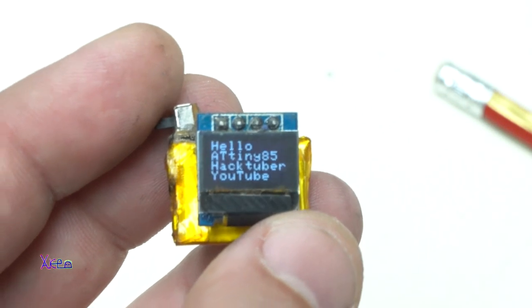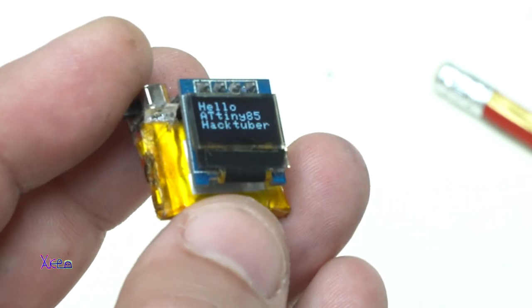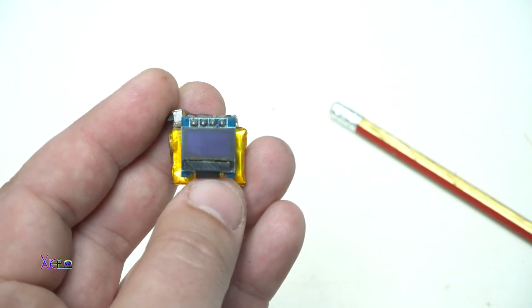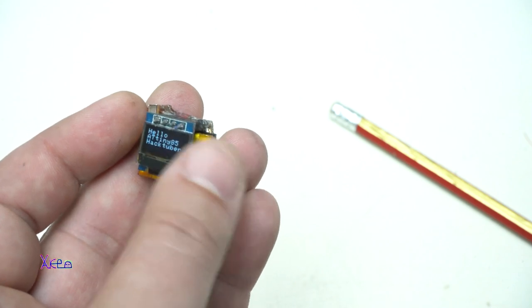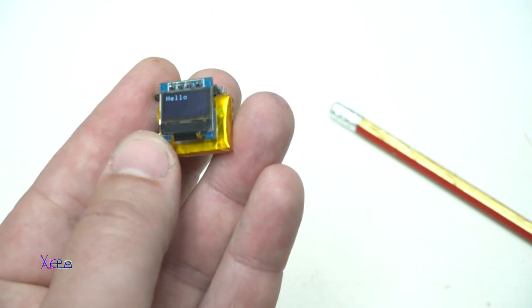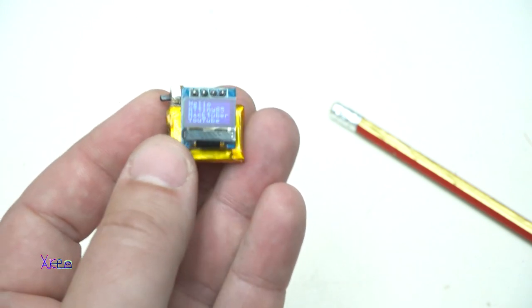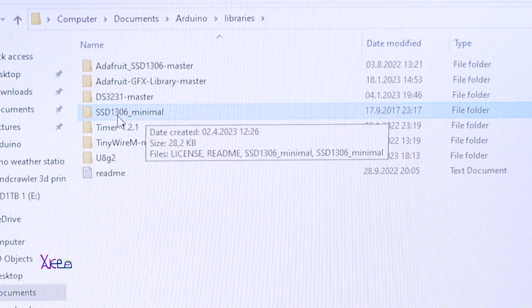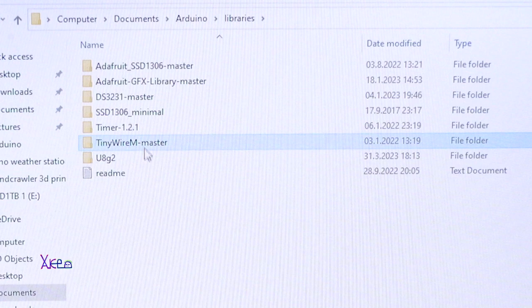In the description below I will put links, you can download the code. The code is the same for using the ATtiny85 or ATmega328 chip or Arduino Uno, and that's it. For the Arduino code to work, you need to install libraries, and these are two libraries that you need to install, the SSD1306 Minimal library and the TinyWireM library. Without these libraries the code will not work.